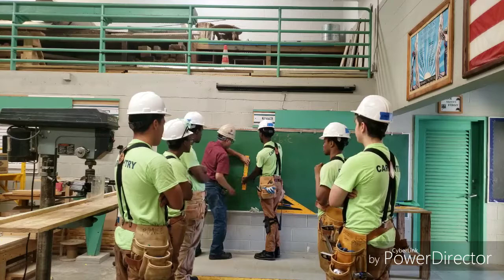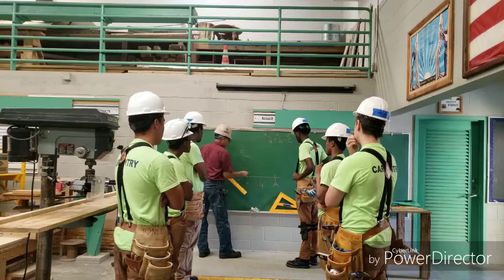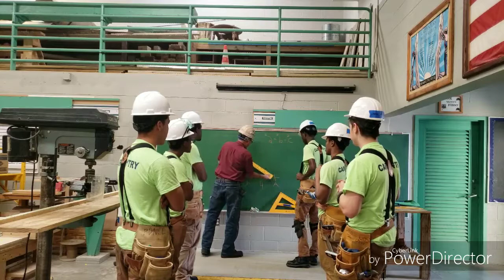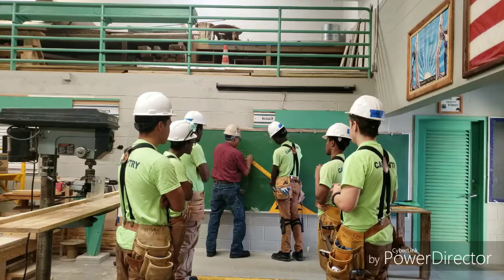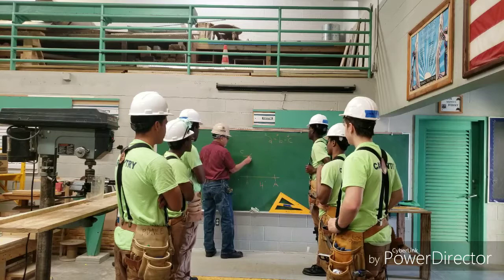Right? Okay. And then now I'm going to scribe another arc from point A to point C. This is going to be point C where the vertex joins at this point. So from point A to point C, I'm going to scribe an arc at 50 centimeters, which represents the 5 feet side. All right, so hold it right there at that point. And now I'm going to scribe another arc right at this point. This is not an exact method, but okay, so where these points join together at this vertex, that's point C.